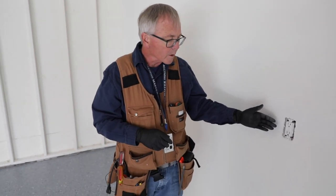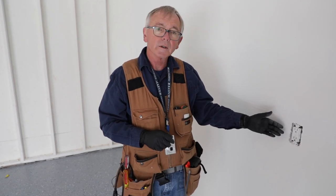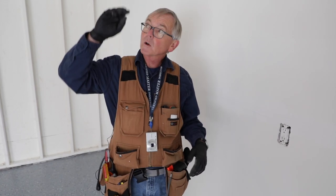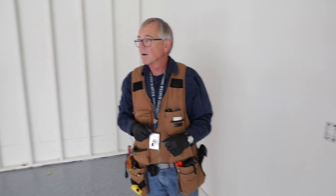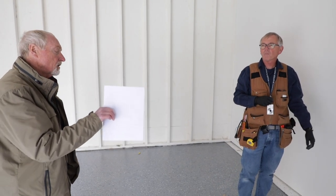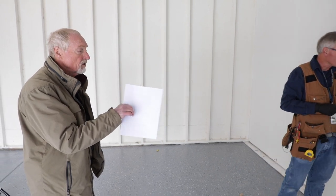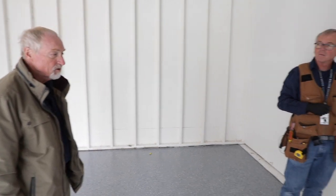About missing device covers: if they're within reach of children, it's very important — a huge safety issue to get these covers on. If they're in another location, perhaps on the ceiling of the garage or somewhere out of reach, it's not such a huge deal, but we're still pointing it out. One more thing about GFCIs: the manufacturer's recommendation for testing is to press the test button. But most of us will use the three-light tester, because that's what we do. Now let's go ahead and move inside to test some more receptacles.